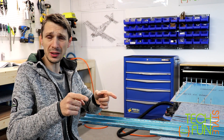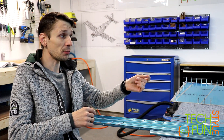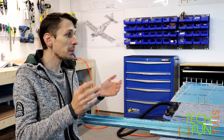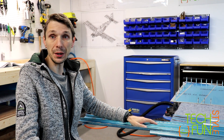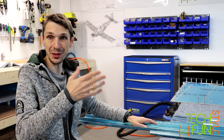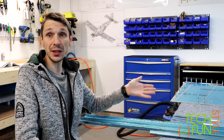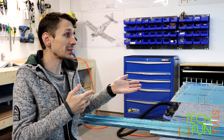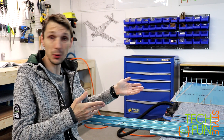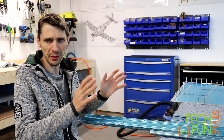So what I did, I just clecoed everything. I wasn't able to demonstrate the use of the tank sealer and how it should be applied to the trailing edge. I hope I'm going to do that later, maybe in a year or two, when I'm ready to proceed with the inspection. For now, my rudder is technically ready — I maybe need to invest another five to ten hours in it, maybe even less, maybe around five hours.